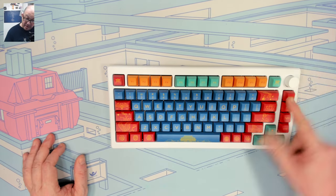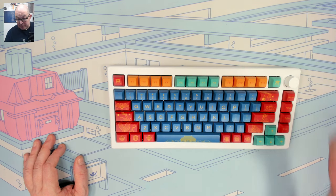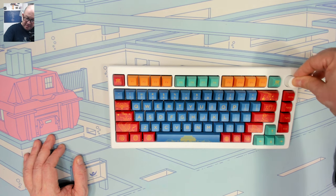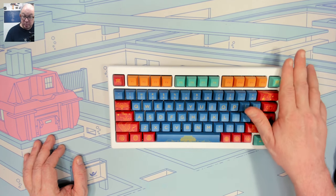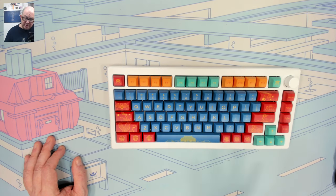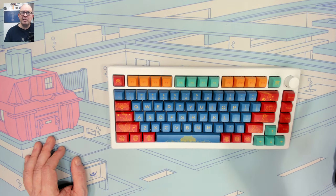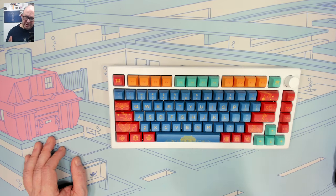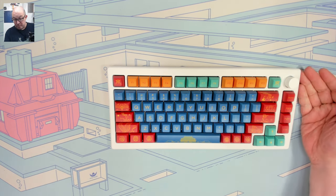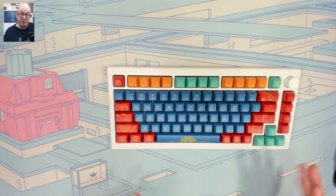And again, attached to the PCB, we have that nice big block of solid, more rigid foam that's going to prevent any issues with the knob, because I do believe that was an issue with some of the V1, the first revision of the MOD007 from 2021, I think, when they came out. I believe they would get loose after a while, but because of the flex, this prevents it from loosening up and the solder joints breaking.